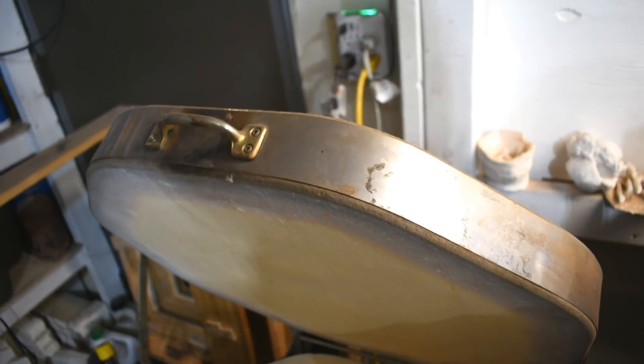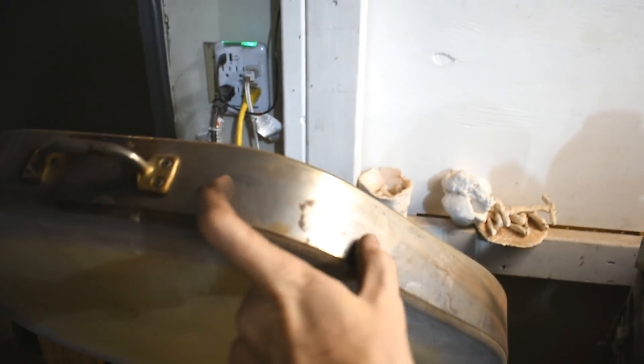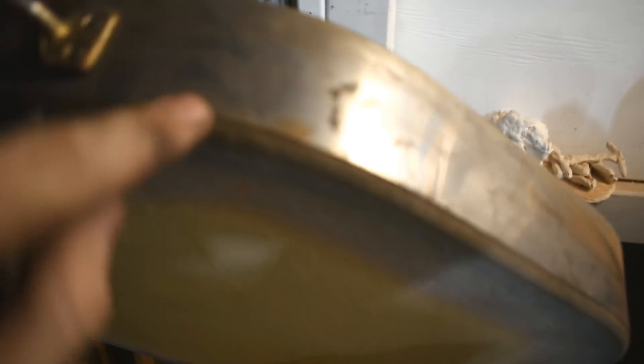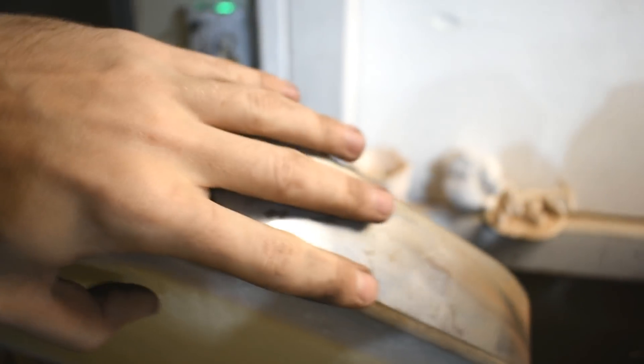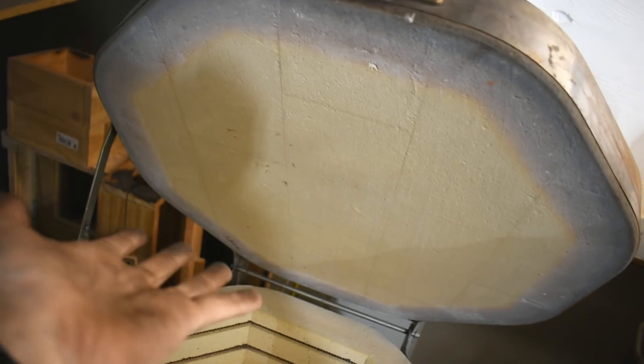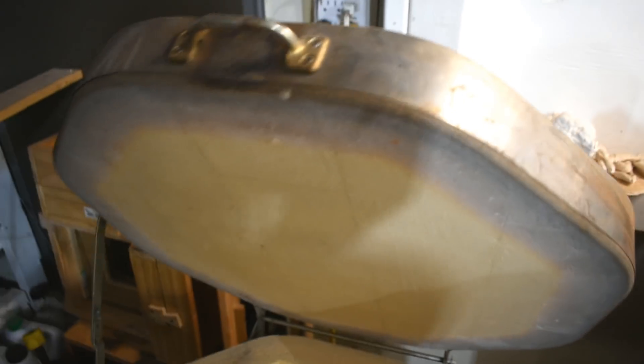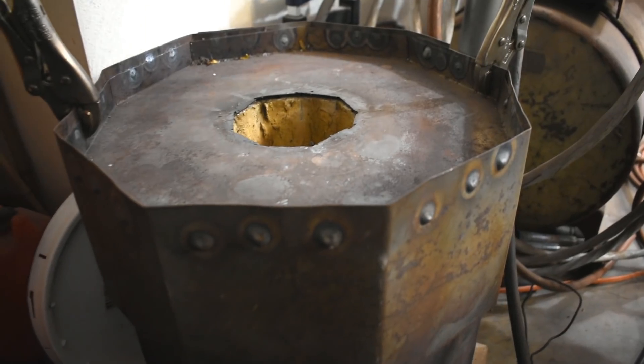For the lid — here's the lid on my actual kiln. You'll see it's made out of bricks covered in some stuff, and it's got this strip of stainless that goes all the way around. In the back there's a screw thing to tighten it, so it's one strip and you can tighten it. It doesn't curve under or over the bricks at all — it just uses tension to compress all the bricks, and the bricks fit so tightly together they form a nice tight structure. There might be mortar in there too, I really don't know, but it's pretty solid. So I'm gonna try that solution as opposed to the foundry furnace solution — but I don't even have a metal strip.